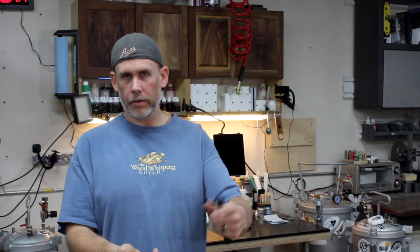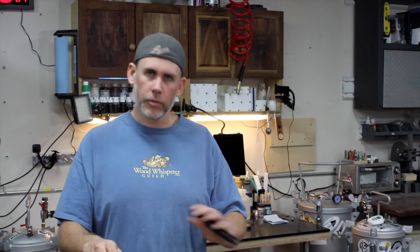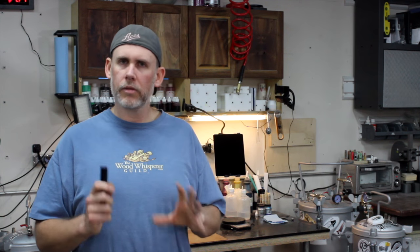That should help out. Now you really want to turn the lathe on, spin it, and sand it radially. Then I recommend going lengthwise with the tube. Turn it off and hand sand lengthwise. Then, once you've gotten all those lengthwise scratches out, you've done your job and you can move on to the next grit. I successively do both of those sanding steps on each grit, and just make sure you give it enough time. You can wet sand throughout the whole sanding process. That'll probably clear some of that swarf away and help out a little bit.